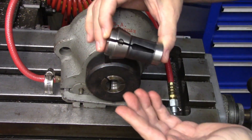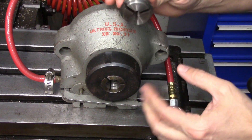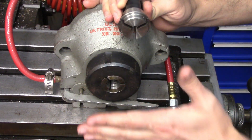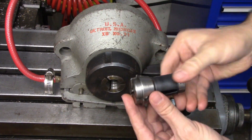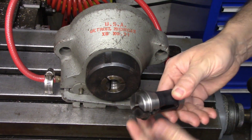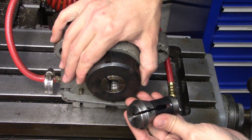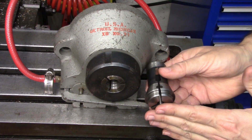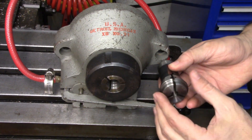These are pretty neat, though, because they're what are called dead-length collets. If you've never heard that term, what it means is the end of the collet is always in the same spot. It doesn't move back like a 5C does as it gets drawn into the taper. Instead, the taper — in this case it's pneumatic — gets pushed up against this, and this little recess here is captured by this threaded collar.